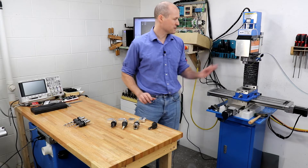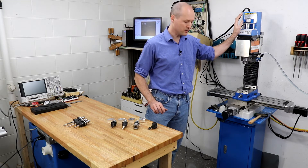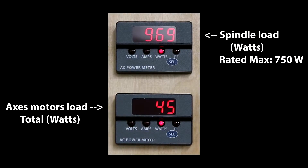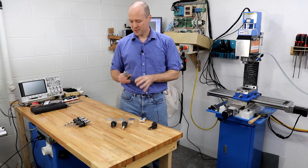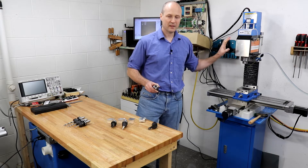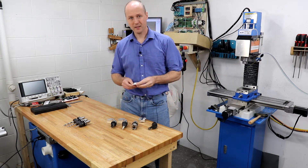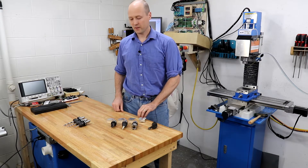While performing these operations on the mill, I'll monitor the load on the spindle motor and the stepper motors using power meters from Murata. Long term, I want to create a catalog of parameters for each of these tools that are known to work and provide high performance on this mill. Performance is determined by the quality of the cut and how close the motor is to its maximum.